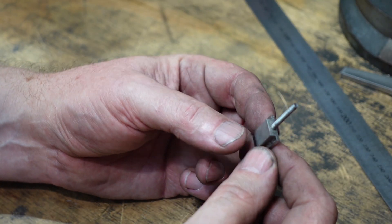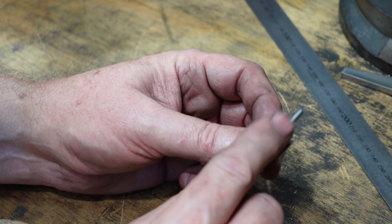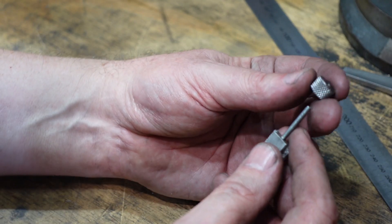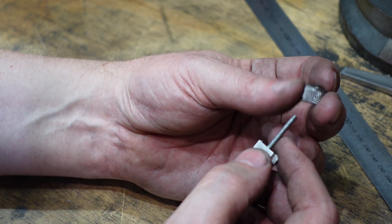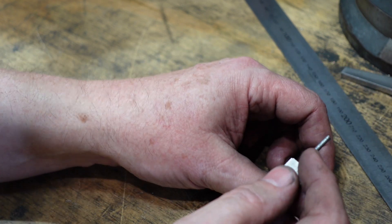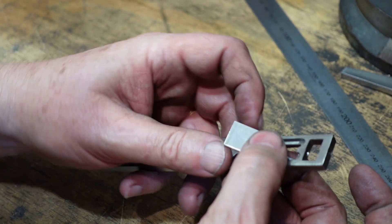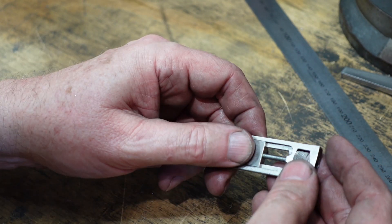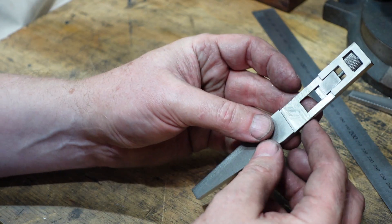After doing all that machining it's then a matter of putting an M3 hole in there and a piece of all-thread — that's 21mm long, and I'll show you the reason for that in a moment. What I haven't shown you making is this: it's just a nut, around 7.5mm high, about 12mm diameter, with an M3 thread in it, so it screws onto there. The way this all goes together is: that piece goes into the hole, the nut goes in, and that just screws up like so — and that's basically all there is to it.